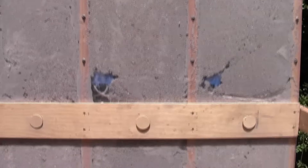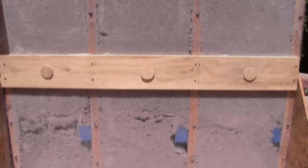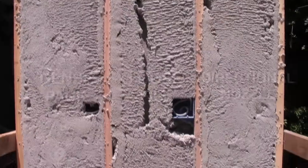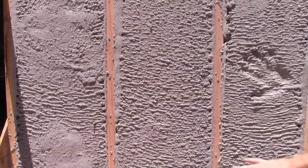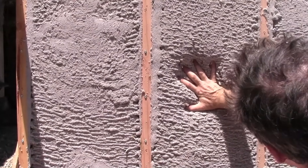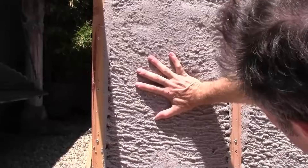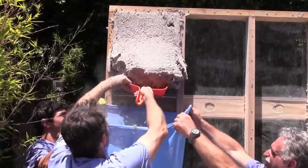Here we show the results of the three techniques. We removed one side of the wall and show the density of each cavity, and then we weighed the insulation from each cavity. The directional nozzle bay and the loose fill bay are soft to the touch, demonstrating how they will settle over time. The last is the dense pack section — it's easy to see how firm the insulation is in the cavity and how difficult it is to remove.